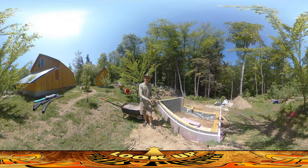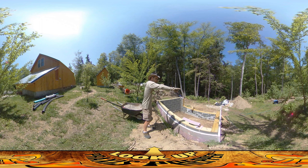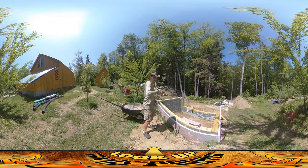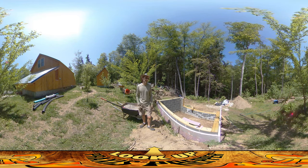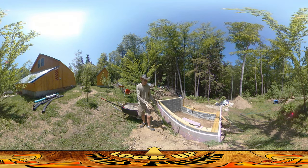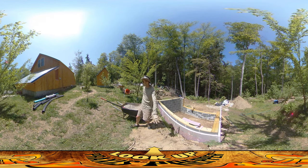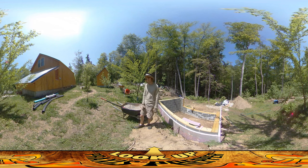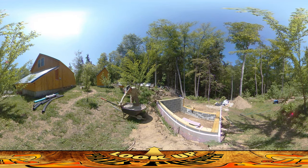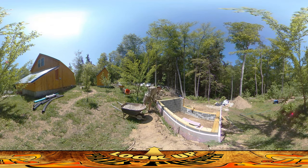So I'm making the best I can out of the situation created by my own sloth during excavation. What I'm doing is kind of like a French drain — I'm pouring in the gravel so that when water gets in there, it doesn't just sit up against the foundation. It'll have a way to flow through the gravel and get out the other side. We do get a lot of snow coming off the back of the house piling up here, and in the spring that flows out this way, but we also get a lot of plants drinking it up. I'm trying to psych myself up for this being an okay idea.